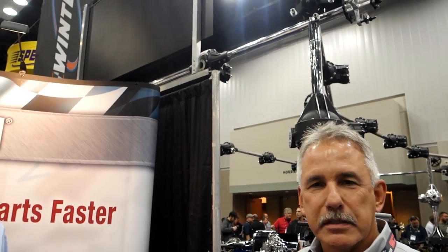Now, what's unique about your process is that it's a chemical accelerated process, right? Yes, a chemical mechanical process that allows us to refine the surface of the components without removing too much material. Our biggest benefit is that we impart a texture on the surface that allows the oil to adhere to it. That gives you better lubrication performance, lower operating temperatures, and better durability for your components.